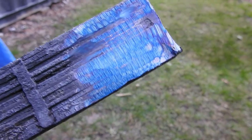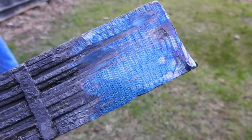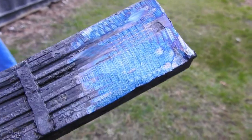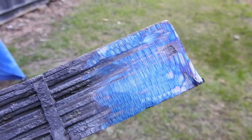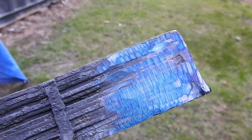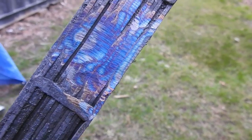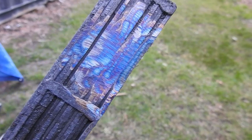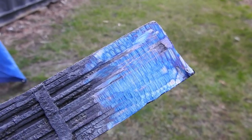Well, I've ground some of it back. It's still really hot, but I think that's welded. These bits just at the bottom of the screen, whilst you can just see the line, there doesn't seem to be any airspace between them, so I think the weld was actually taken pretty good. And just up the top section, you can see we haven't quite ground down enough. Over this side, ground a bit more, and the sections where I got down enough, it was good. So it's just getting rid of the slightly different thicknesses of the steel, but all in all, I'll say that's a success. Well, it is for me.